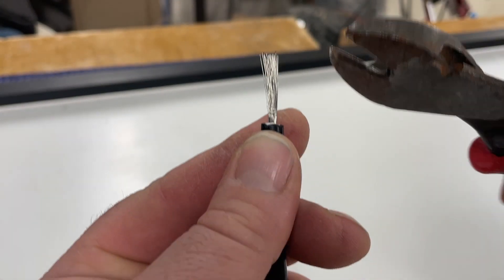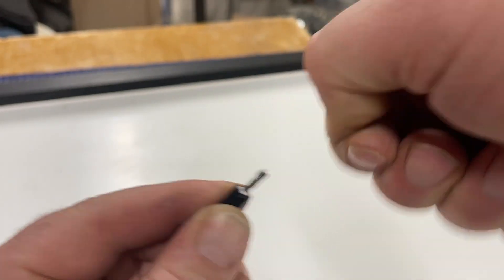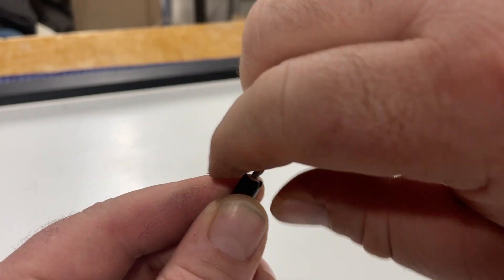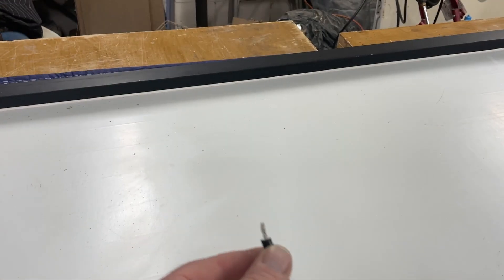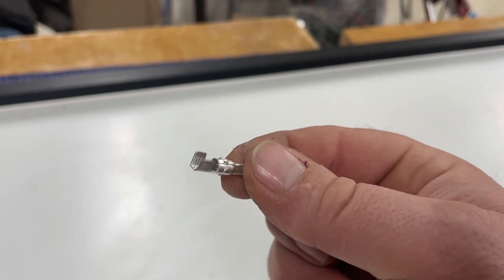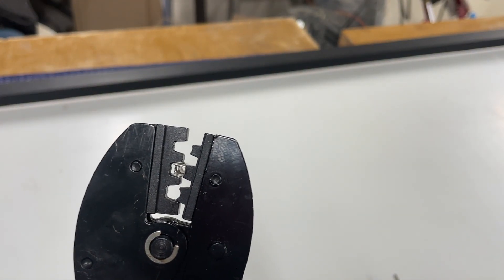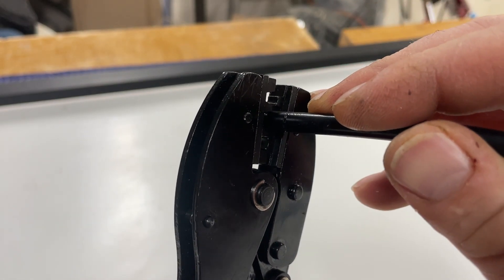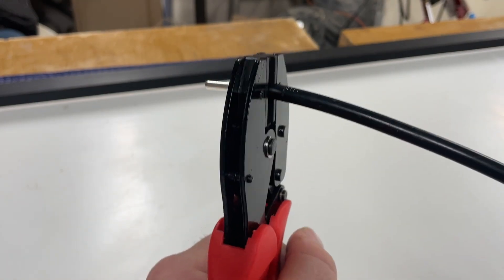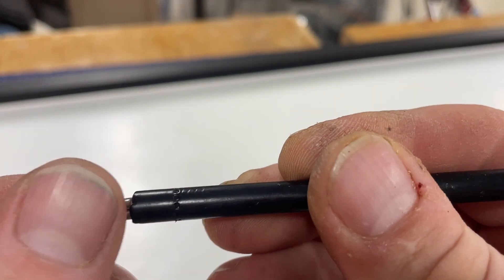On to the negative — that's way too much wire, so I'm going to cut about that much off. You want to get all those loose strands so when you stick it in, every individual wire goes into the crimp. I'm going to stick that on the middle teeth and go ahead and bite down, so it's set but not yet crimped. Now I'm going to stick the wire in the hole, seat it all the way down, and just crimp away. Verify your work — you can see how the actual crimps have bitten onto the wire, which means it's not coming off. Exactly what you want.